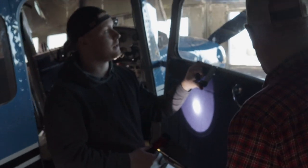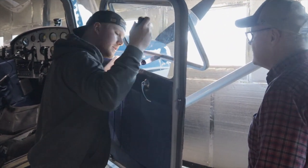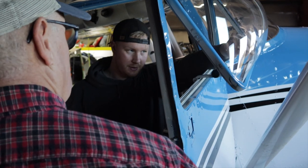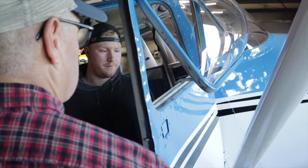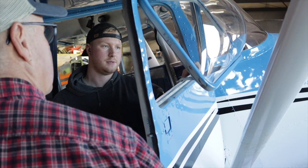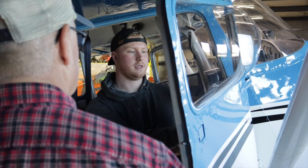There are definitely some door fit issues. I think these are not 170 doors — or they might be 170 doors with the newer latch. The other thing that got me wondering is how they got the 6-inch windows without the auxiliary stop. Because they have this secondary latch. All the other bubble windows I've seen have that secondary down here. Above the 2-inch, you're recommended to have it — you're supposed to have two. Part of it is bad door seals, or you can flip that thing and the window just flies open at 150 miles an hour. I told Larry not to open these at all.